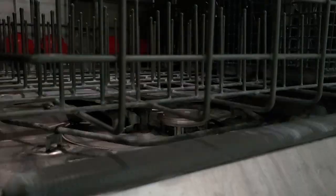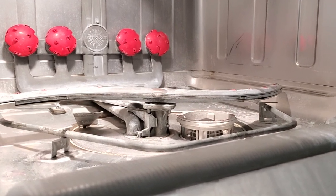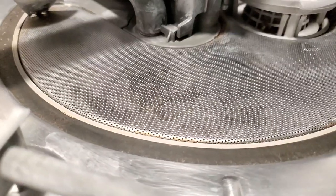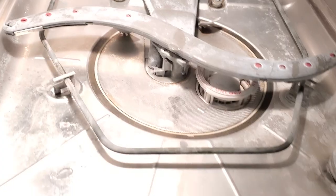You could immediately start hand washing all dishes and use the dishwasher as a drying rack. This might not be the best idea because of the eventual buildup at the bottom of the dishwasher. Moreover, you could cause long-term damage to your dishwasher from a lack of use. Seals could dry out, and bacterial growth at the bottom of the unit could trap stagnant water in the drainline loop. Dishwashers are not intended to be expensive decorative drying rack boxes.